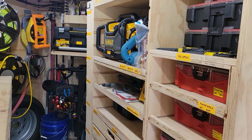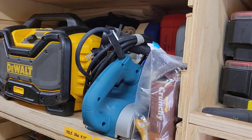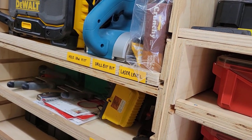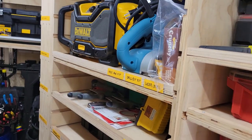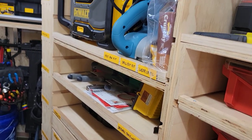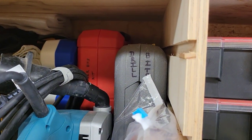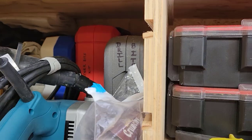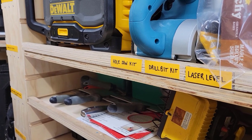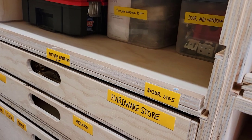Here we go with Drawer Bank 3. This is an entire cabinet. It actually has two sides made out of 3-quarter or 18-millimeter ply. It has a ceiling and probably spreaders for a floor rather than a solid floor, and a back — so it doesn't have a solid back or solid floor. And then I have all of these either dadoed or routered slots which accept either a shelf that slides out — really a drawer without sides or a front or back — and of course the drawers themselves.